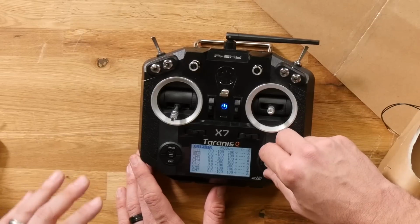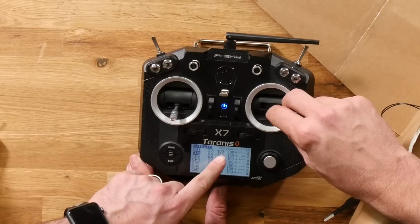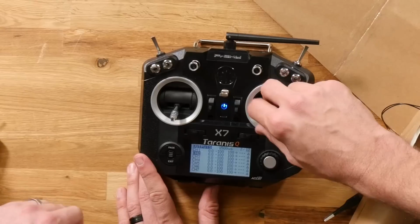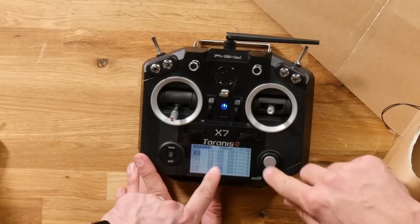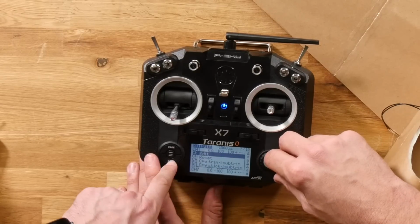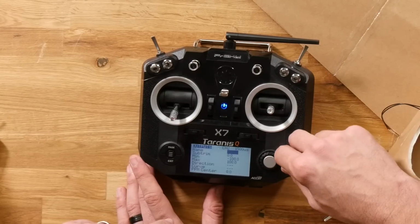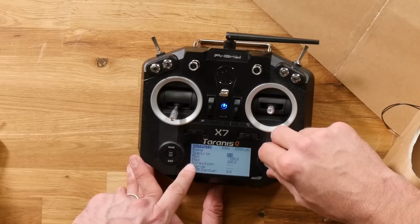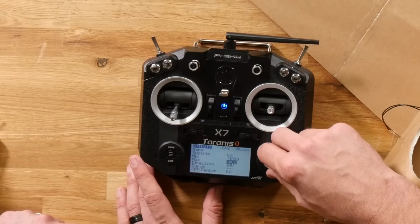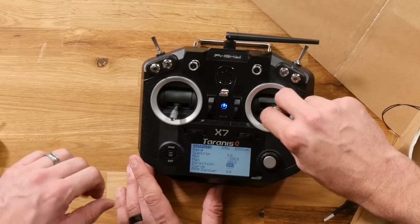Our aileron was channel 2. If you want to check that, go to channel 2. Right here at the top, you can see your numbers moving. That's the pulse width, the PWM signal. To change it, you have different values here. Tap it one time. Edit. Go down, you have your sub trim, your minimum endpoint, your maximum endpoint, direction. Invert. Done. Easy enough.